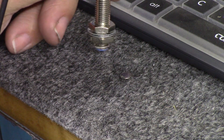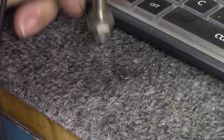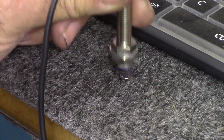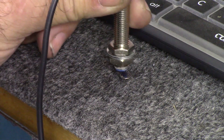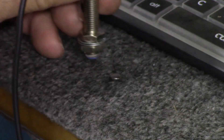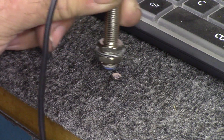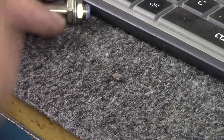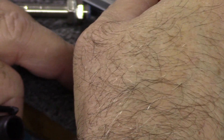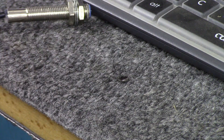When you set up switches, you don't want the sensor to come face-on to the target — you want to hit it sideways. It's better to come across the face of the target, in this case the magnet. So what I'll do is mark my magnet with a Sharpie so I know that's the face that needs to go facing the sensor.